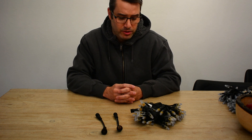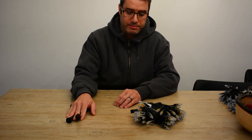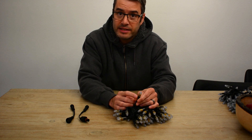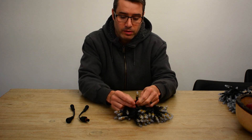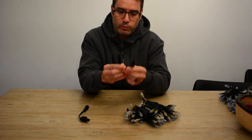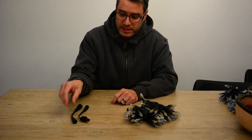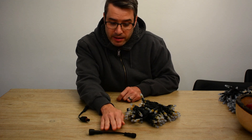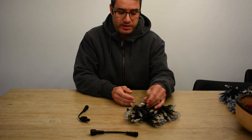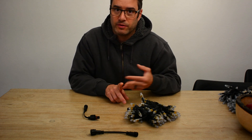I had some interesting conversations with people in online groups who were testing GS8208 pixels and discussing how you're supposed to connect these lines. If you're not using the adapters, on here there is a 12 volt, data-in one, ground, and data-in two. What was originally explained to me is that one of the data-in lines needs to be bonded to ground. So basically these adapters give you data-in, ground, 12 volts, and then the extra data-in line gets bonded to ground.